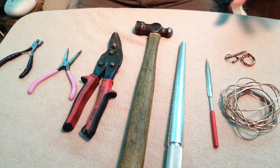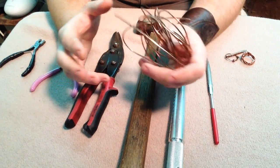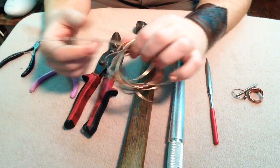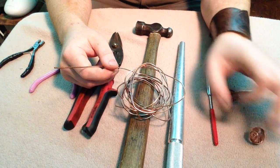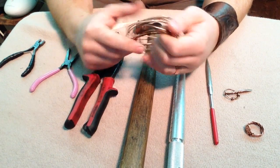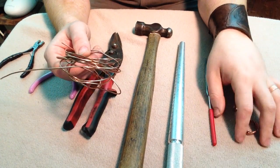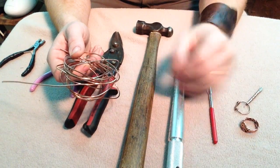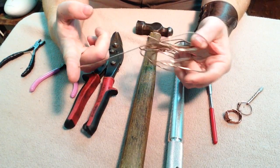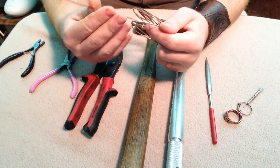The materials for this are very simple — just a length of copper wire, silver wire, or whatever metal you want to use. The softer the better. You need a length big enough to do the appropriate number of wraps, and anything between 16 gauge up to 8 gauge will work. 8 gauge is really hard to use and you have to taper the ends, but it's still fairly nice. Anything bigger is too hard; anything smaller will just crumple. This is 14 gauge — it's the ground wire from Romex, a pretty easily available electrical wire that's fairly soft.